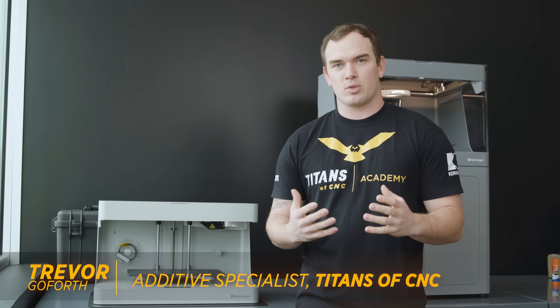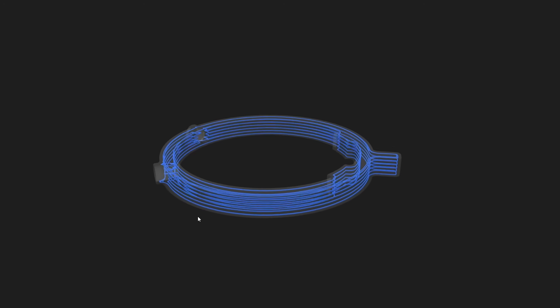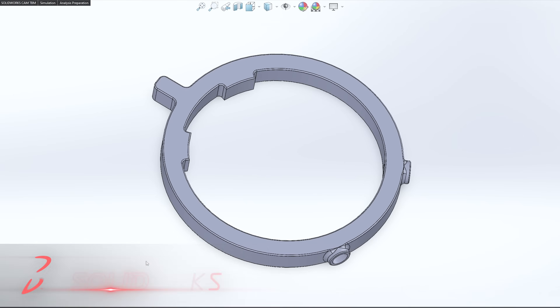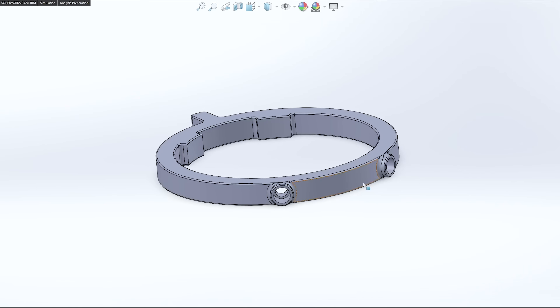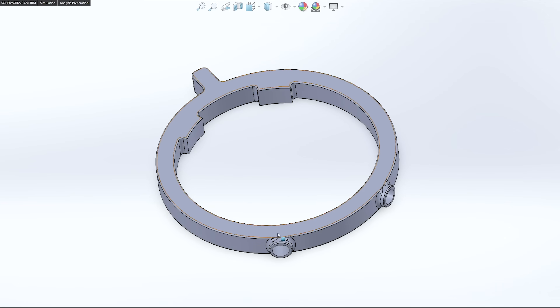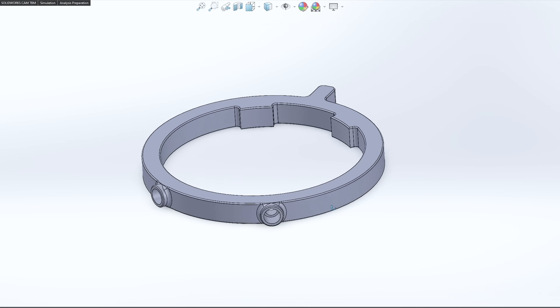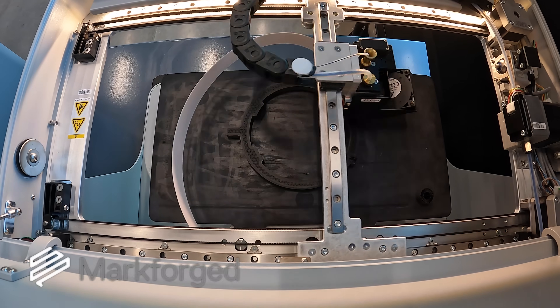If you notice all the blue running throughout this part, those are continuous carbon fiber strands — we've got about six layers of them throughout the part. In the design of the drive dog, we increased the diameter so that the part will fit inside of it. I also added another screw instead of just one in the center, and these screws are directly in line with the center of the radius on this pad. We're also going to add heat set inserts inside the holes to reinforce the threads, then route some carbon fiber through the part.